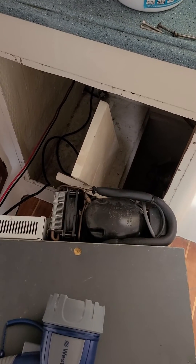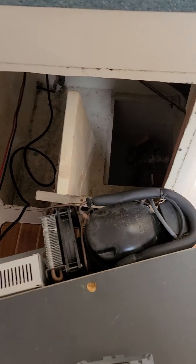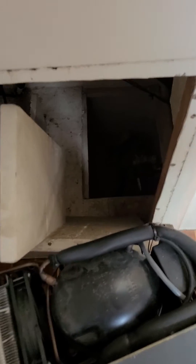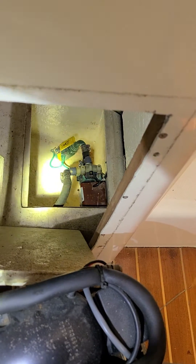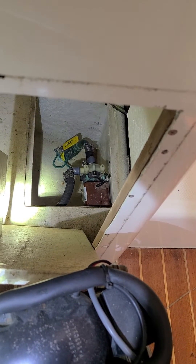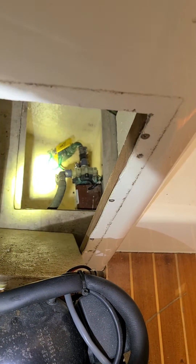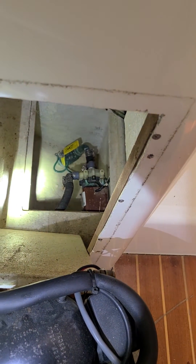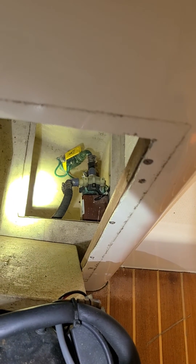So this is the area behind my refrigerator. There's a few screws that hold mine on — take that out and pull it out and you see this board sticking up. It covers up that hole down in there. Get some light in there and you can see there's a pump, and that is the through-hull where you have the water pickup for the AC system. You can see there's also no strainer in there — that's another thing on my list to add. There are two hose clamps there.